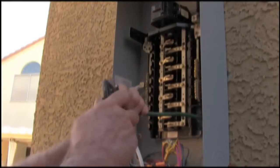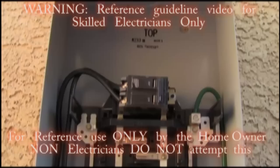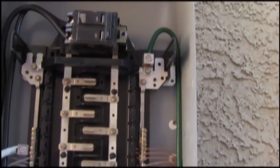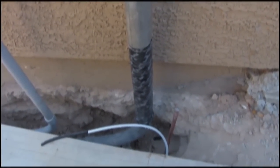Same on the ground wire. Starting from the top down: the main breaker is connected, the neutral is connected, the ground is connected — I went overhead with that. The bushing is on, the riser is secured in two places, and it's waterproofed to eight inches above grade.